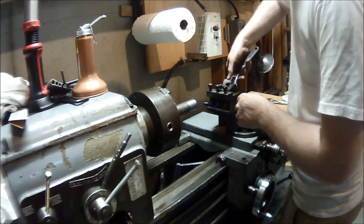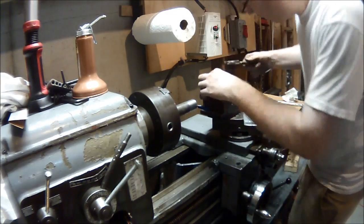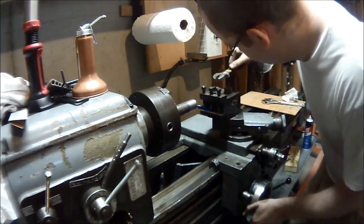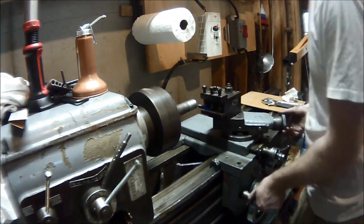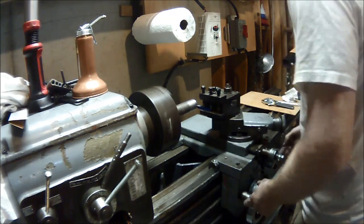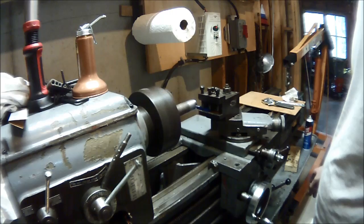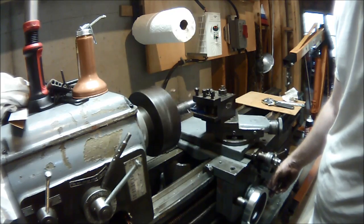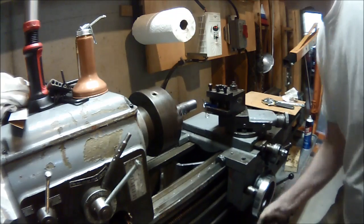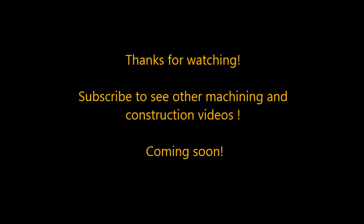I back it out and turn it off. The finish is marginal but decent. I grab the spanner and tighten up the adjustment screw to pull the tool up — it probably had to come up four or five millimeters. I fire up the lathe again and use the compound to engage. The chips are coming off awesome. Since it's a cheap set of carbide brazed-on inserts with no chip breaker, it still came out great for the material I was working with. I adjust the cross slide back and couldn't be happier with how this worked out — this project had been a bear.